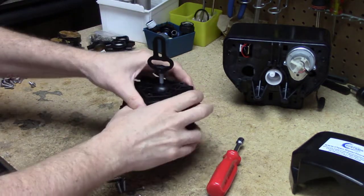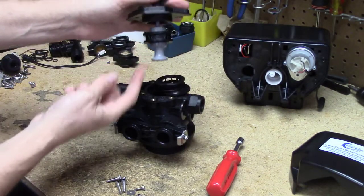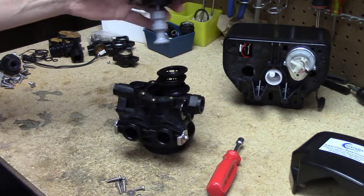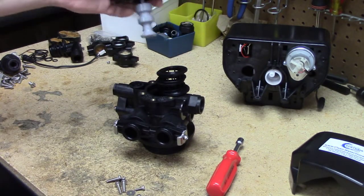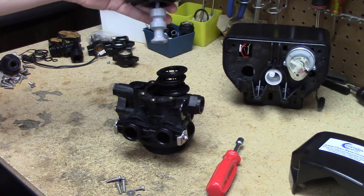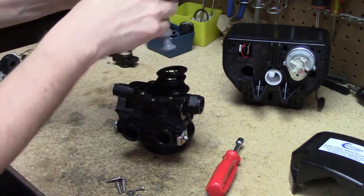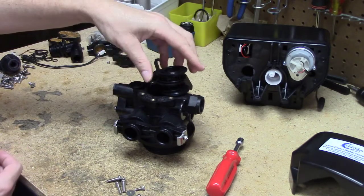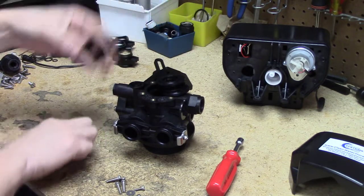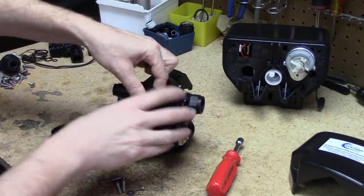Once you unscrew those three screws, you pull the whole thing up, and as you do, you'll pull some of the seals and spacers off. What you'll have is the piston. There are five rubber seals and four plastic spacers — they come out one at a time. This is a brand new valve, but normally you're doing this because the valve gets gummed up, especially on an iron filter valve with rust-colored deposits and grit.